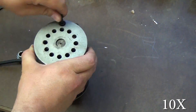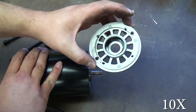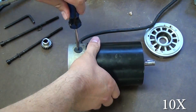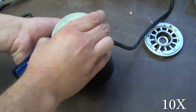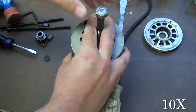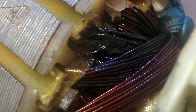Sure enough, you're going to see here in just a second — one of the bundles of conductors in the armature have actually welded together, so this motor is completely junk now. I called Grizzly; they've discontinued this motor because too many people are burning them up. They've replaced it with a new model — same part number with 'V2' after it — basically the same motor but with an internal breaker. Here you can see that welded bundle of wires in the armature; it's all discolored and totally toast.